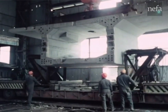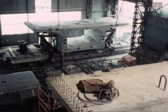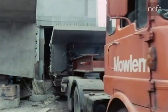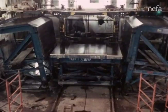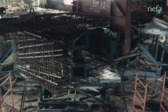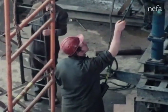The previous segment, two days old, is ready for transfer to the stacking yard. As one box leaves at cycle end, another casting cycle begins. The empty pallet is transferred to the vacant casting position, and the cage moves across from the preparation area to the casting machine for placing.